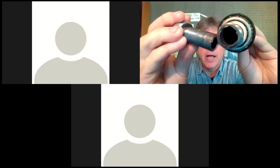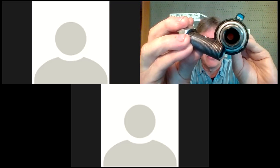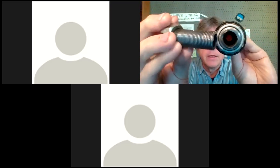And the other thing is, the place where it broke was right where the threads end. And if you look at the depth of the thread, you look at how much shiny metal and how much dull metal we have. That kind of gives you an idea how much metal was cracked. And you can also tell how long it's been doing it based on the shininess. Yeah. So it was an accident waiting to happen. Luckily, it happened in the hangar. Yeah, that would have been awful if you were landing and it broke like that.